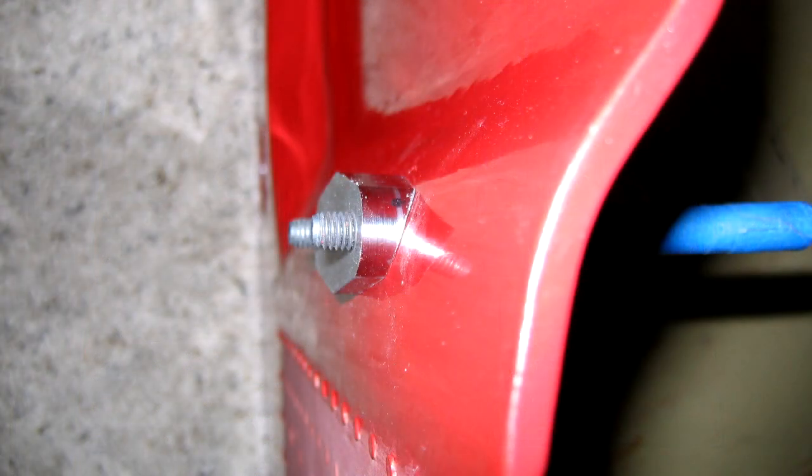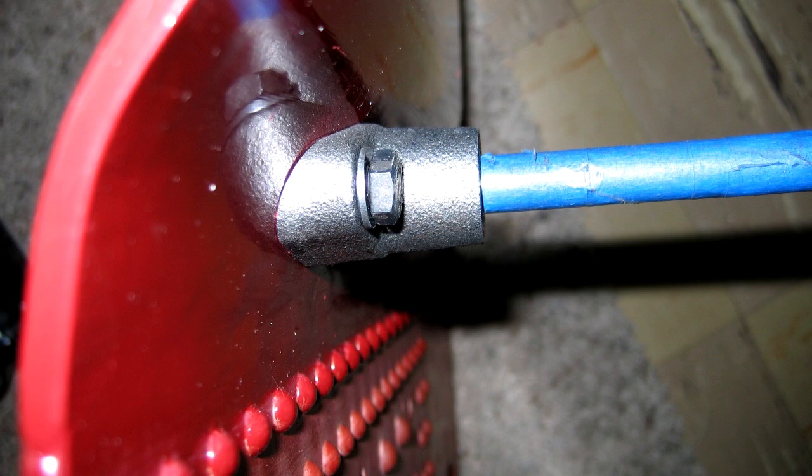The flywheel brake pivot and bolting block need to be fitted to match the curvature of the left horn plate. A combination of dremel, files, and sandpaper were used to slowly remove material where necessary to achieve a good fit between all pieces. The parts were continually attached to the horn plate to check what areas needed material removed so mating surfaces were flush. A combination square was also used regularly to ensure the brake pivot shaft was squared to the horn plate in all directions. A permanent marker was used to mark areas needing filing and grinding.